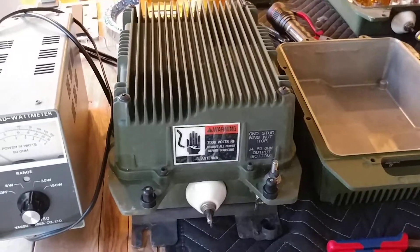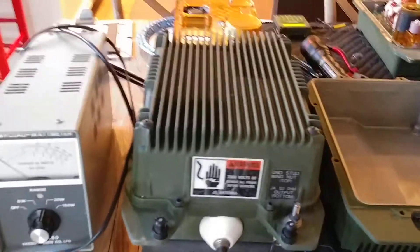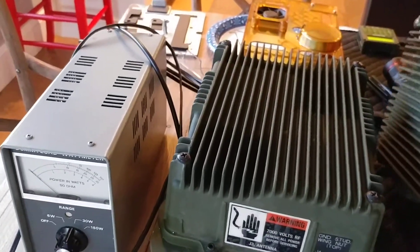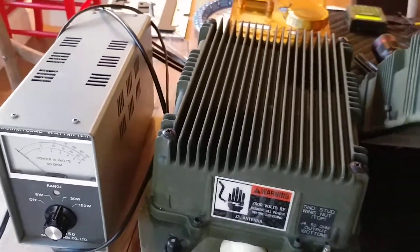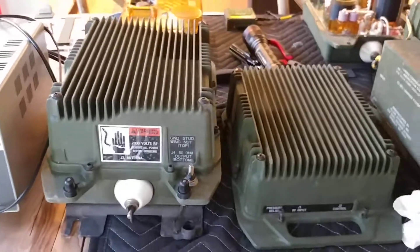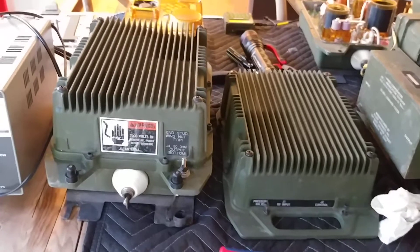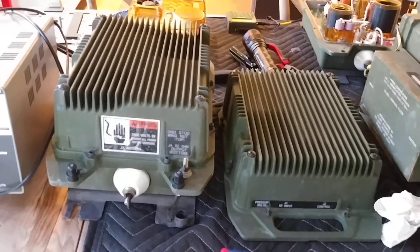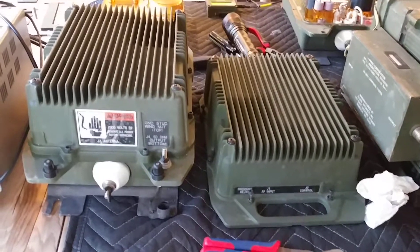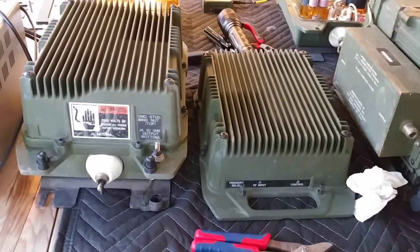What's interesting about this setup is that the cable was not the original cable, because those cables are impossible to find. I bought some cables off eBay that at least had the right connectors and all 19 conductors in a one-to-one pattern flowing through from one end to the other. I figured what more could I possibly ask for — and yet nothing was happening. The units were just dead, no activity, no relays.